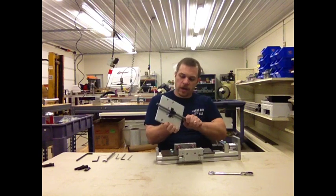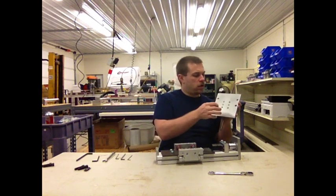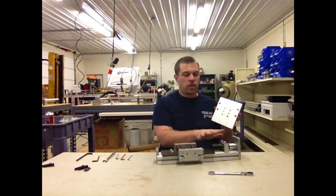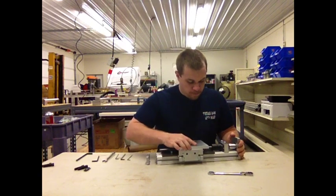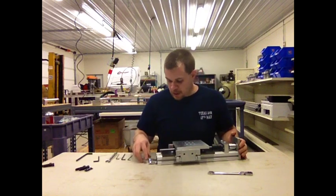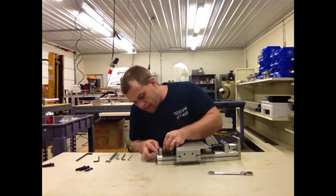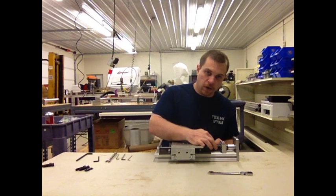Now we're going to turn the rod so the nut has a little bit of leeway on each side. There is the side with the slots, and this top side is going to face towards the bearing block assembly. So we're going to take this side and slip the lead screw into the shaft collar. Then we're going to take the low profile bearing block assembly on this end and slip the lead screw into that. When you slip the lead screw into the collar assembly, notice there's a line in the collar that separates it in half.